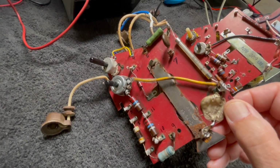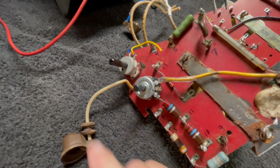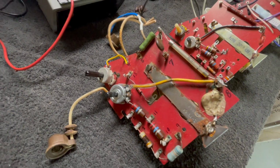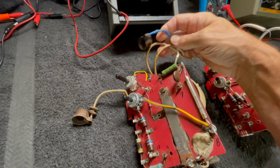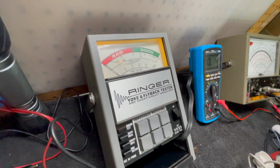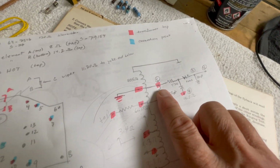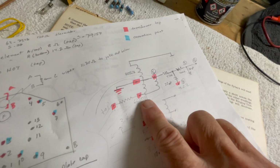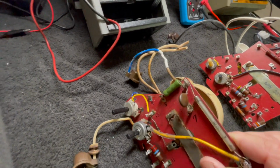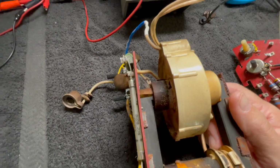So if we go back to our original flyback, I thought we did a pretty good job on replacing the controls. I've checked continuity on this whole transformer, and everything is there. Done some ring testing and trying to measure across the coils from the tap points to another tap point, and all the taps off of this transformer winding have continuity.